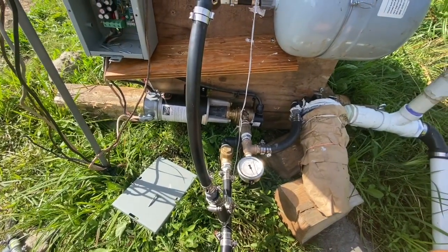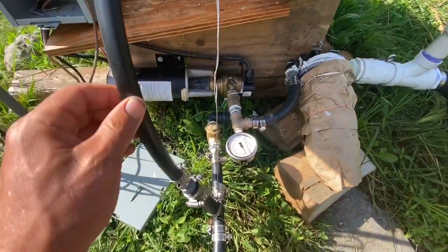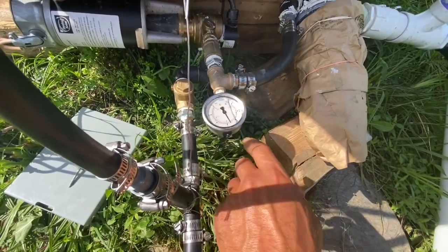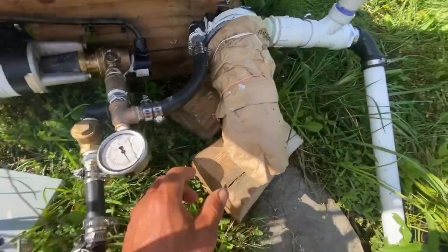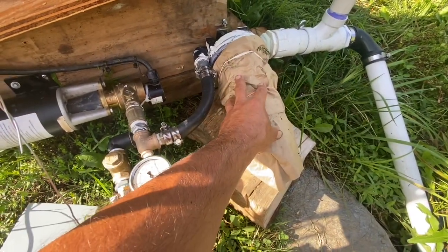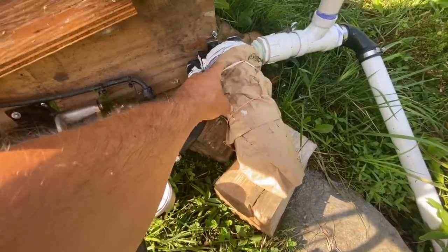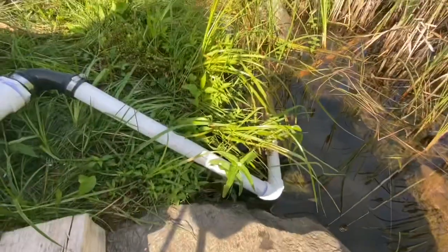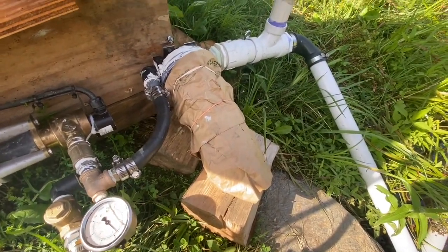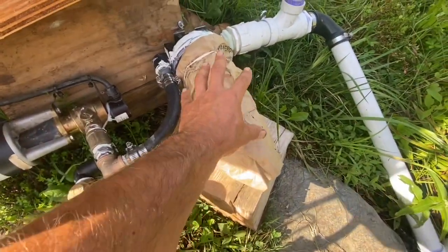It's working good. I have had to add a few things to just keep track of it. This is a vacuum gauge — measures positive and negative pressure — and that will allow me to know when I'm changing my filter. The filter's in here; that's just a regular filter unit, it's five micron. It could probably be 10 or 15, I'm told by the techs at Dankoff. But this is a pain to change when you're on the intake part of the system — you have to fill it and prime it. So I want to limit changing this filter.